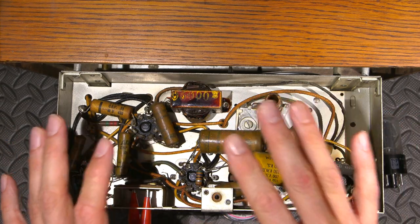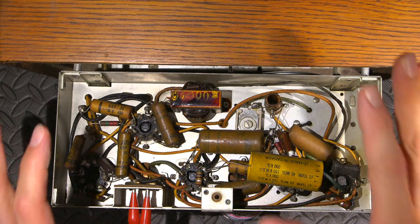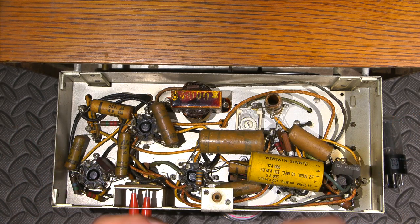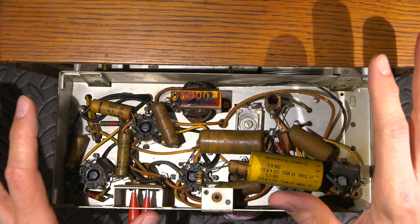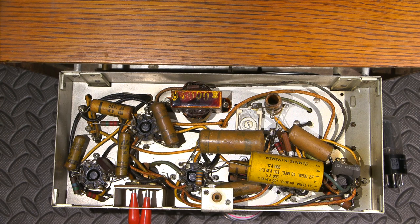If somebody offers to demonstrate a radio to you, they say it works, and they say, I'll plug it in and show it on. If they say it works, it's almost worth, in my own opinion, of course, this is up to you, just saying, okay, if you say it works, and I really want the radio, I'm willing to take the chance. Then take it, and of course, you rebuild it before you power it up, or, like I did, have a current limited isolation transformer and a variac supply where you can bring it up safely.